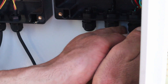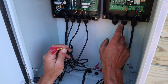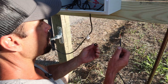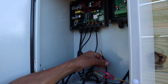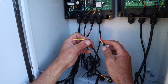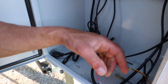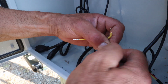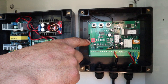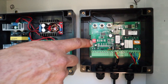Pull the cord down a little bit and secure the cable gland. Then grab the far right cord on the power supply which is already installed, and grab the center cord on the control panel which is already installed also. Connect the red wire to the red and the yellow to the yellow. Then we have the cord coming from our solar panels that we previously installed. We're going to run that through the small cable gland that we put on the bottom of our box earlier. And we're going to take the first small cord — which will be the second cord on the power supply unit — and wire the red to the red on the solar panel and the yellow to the yellow. These wires are pre-stripped but I'm going to strip them a little more to expose some more wire, then just use some small wire nuts to secure it. Be sure no sun is shining on your solar panel while you're doing this so they're not making any current. There are three switches on the control unit that you'll have to consult your manual about if you're using this system as a push to open, but being this is a pull to open, everything will stay exactly how it is from the factory.